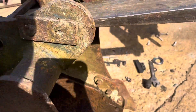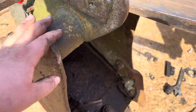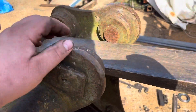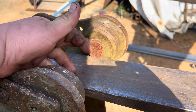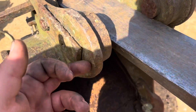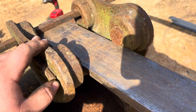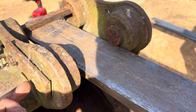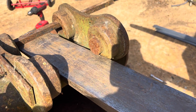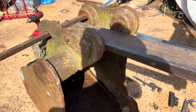We've got here a small ditching bucket, or a trenching bucket. You can see it's got some stuck pins and the ears are bent as well. So we're going to use Exothermic Lance to punch through these, then they'll just fall out. I'll get that set up now.